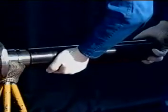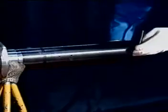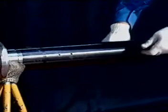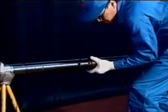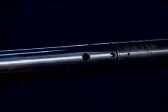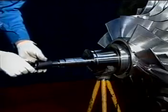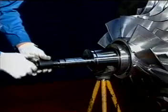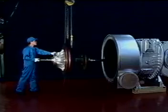Screw the guide tube by the box spanner onto the rotor turbine end. Fix the extension tube and clamp it with socket screw wrench. Screw the eye nut onto the rotor. Suspend the shaft protection sleeve of the rotor by the wire rope.